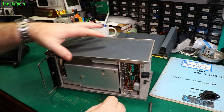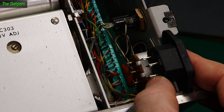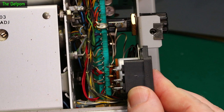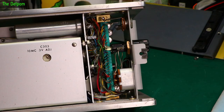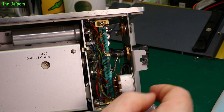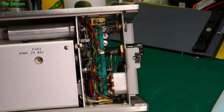Now you get an idea of how little room you've got to work with here. We do have some room but it's not a huge amount. So we allow for the back of this sticking through — it's similar to what's here already. It is going to be quite close to those connections, so it doesn't stick out quite as far as the original once it's flush. This original wiring is awfully thin. This is obviously the AC side because it's the fuse. I'm not sure I like these wires — that's what's there originally, but I might look at replacing just the ones in here. They don't feel too brittle or anything, so they're probably alright. Just want a bit more insulation on wires that are 240 volts.